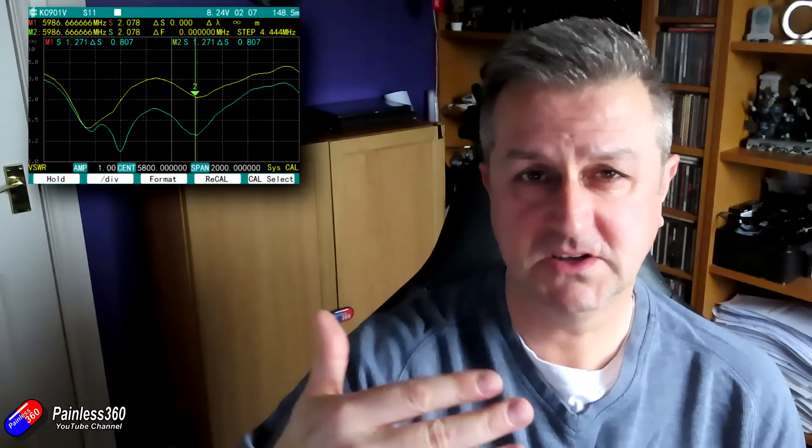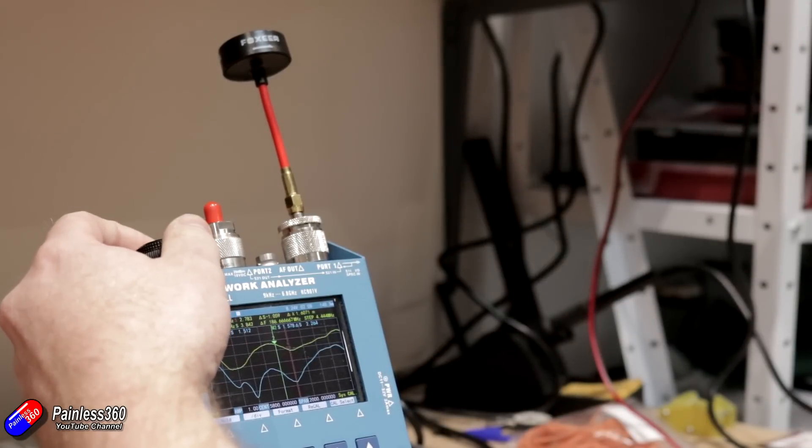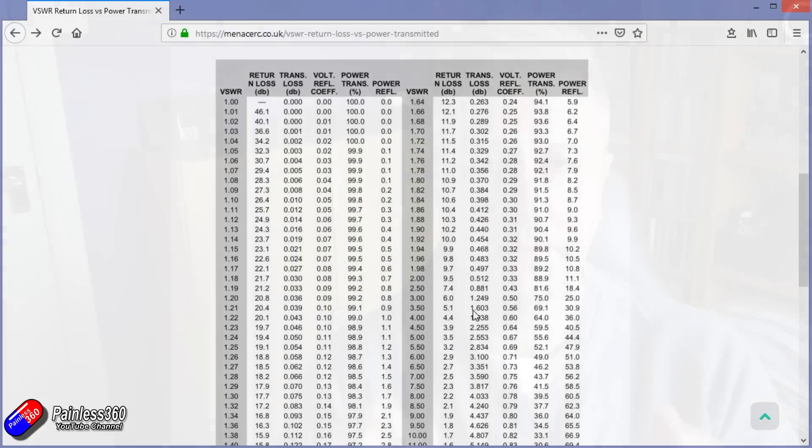Thank you to Greg for doing that. Let's quickly recap on the results. The standard with everything set, measured at 5.986 gigahertz, was a VSWR of 1.27 — which is pretty good. Bending one lobe the VSWR came up to 1.66. Bending a second lobe it came up to just under 2.1 — that's over the threshold that Menace RC would consider a decent antenna. Bending the third lobe brought it to 2.42, and all four lobes bent out of position meant the VSWR was 2.78. That's pretty horrific, but looking at the mid FPV frequency position at 5.8 gigahertz, the VSWR in the middle of the band was a whopping 3.842, which means a huge amount of loss in the antenna.